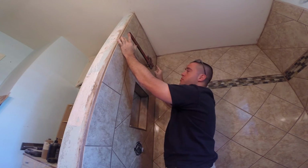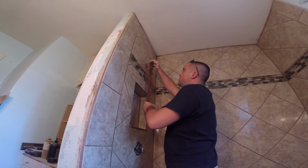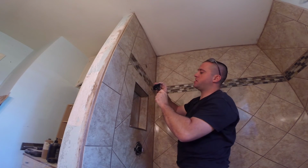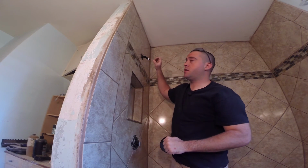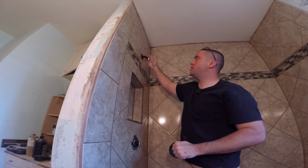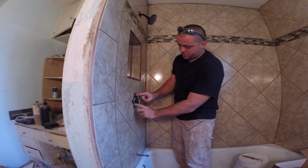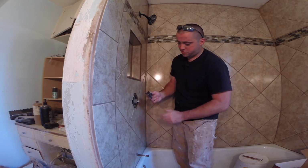So this piece of pipe right here was screwed into that wing 90. So I'm just gonna unscrew it. So I got this fitting that'll hide my cuts. I'll put that on. So I used some pliers with a towel in between it to tighten that down and bring it square with the wall. Now this piece of plastic, this can stay. There's some breakaway clips right here. You just break those free and this comes off.